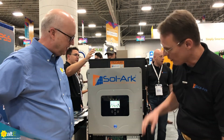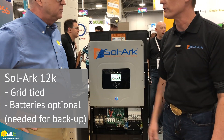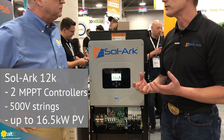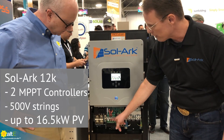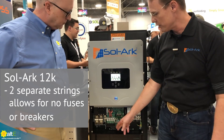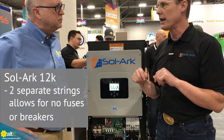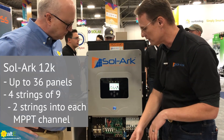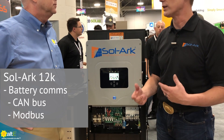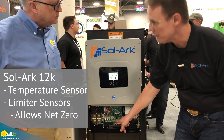This is an all-in-one unit. Batteries are optional, so you can start off with no batteries and add them as your budget allows. We have built-in MPPT controllers — we use large strings, up to 500-volt strings with our dual MPPTs, and that allows us to not use so much wire and no fuses, no breakers, no combiner boxes. It's a very quick install with 9 or 10 panels in series, scaling up to 36 panels all into here. We have battery communication buses to communicate with CAN bus and MOD bus batteries, parallel gangability, temperature sensors, and limiter sensors.